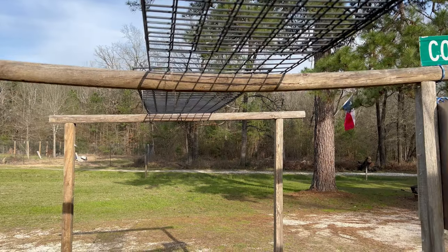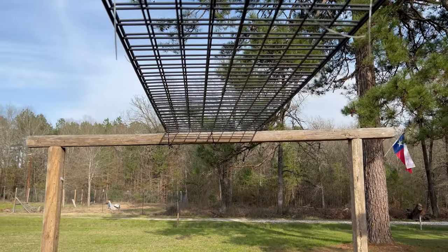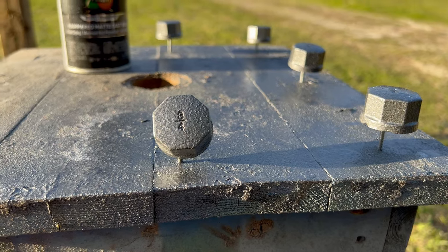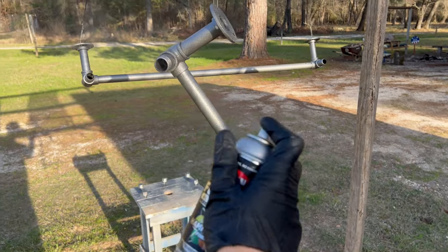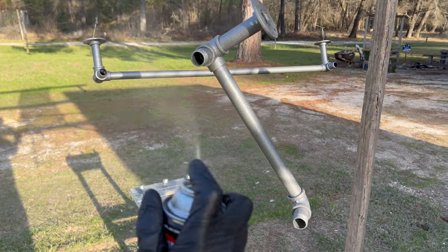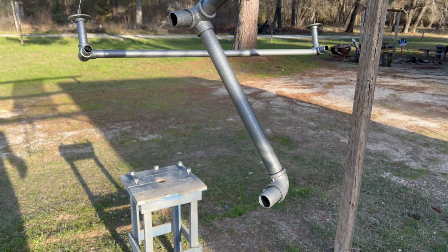Today's artistic tip is to always try to hang your objects. I've learned over time that I get a much more professional looking finish when I hang my objects outside and spray them rather than lay them on a flat surface. I've always found that I end up applying just a little bit too much finish when something's laid flat, but when I have it hanging, I'm really aware that there could be drips and I apply a much softer, much more professional looking finish. The most important thing to remember when using spray paint is that less is always more. You have to have a lot of patience and a keen eye for detail, but if you do, you can certainly achieve a very professional looking finish from just a spray can.